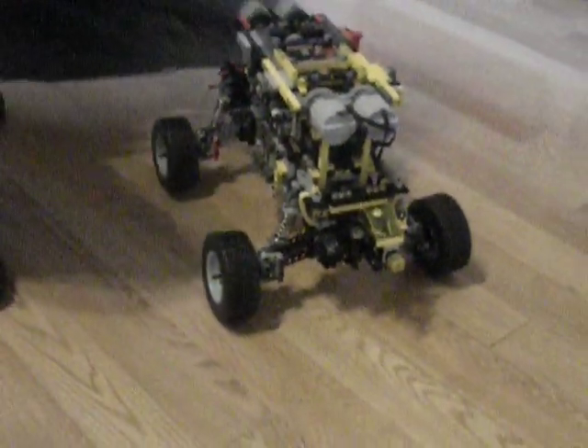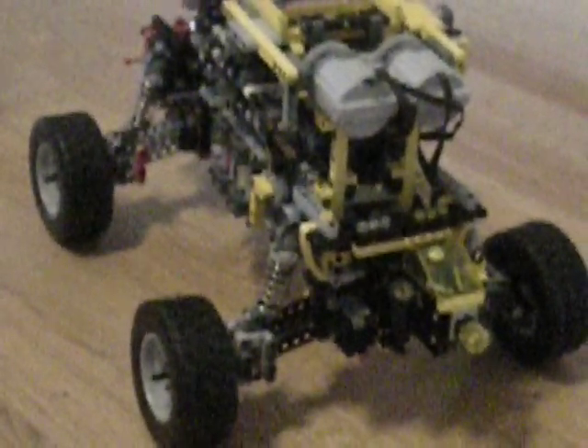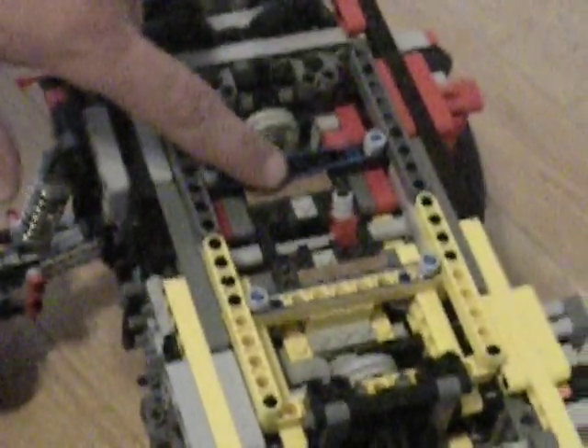So we'll do some driving. Straighten up the wheels. Alright, I believe it's in the low range — yep, we're in the low range transfer gear. And we're going to pop her into fourth gear. Fourth gear represents a 1.5 to 1 reduction. I'll go through the whole reductions of the drivetrain. The engine represents a 3 to 1 first, and then a 1 to 2, so ultimately that's a 1.5 to 1 to the transmission. Right here in fourth gear we're in another 1.5 to 1.